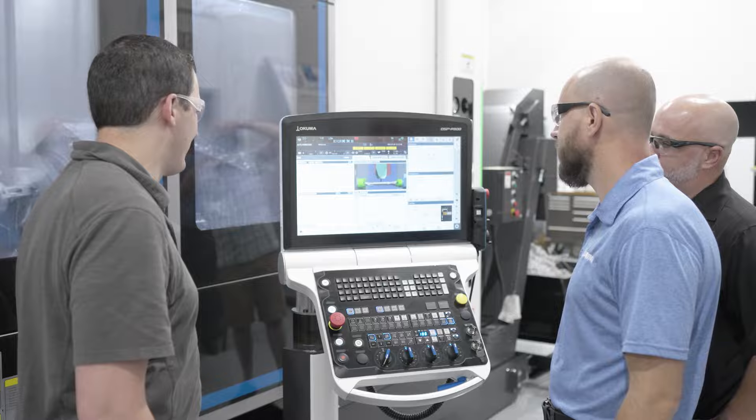There is a lot of stress in the material normally. As you start to remove material, especially in the roughing cycle, the material naturally is going to want to bow and bend. We're using technology on the control to sense that — we can watch the load of the servos — and before every single cut we do a very consistent gentle push of the material and then a gentle pull, so that we're always keeping the material in the same state.